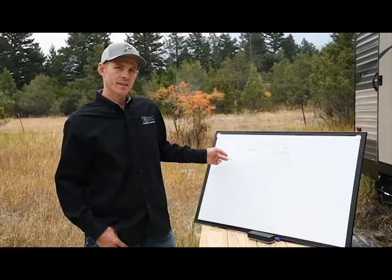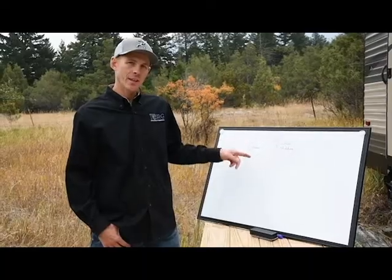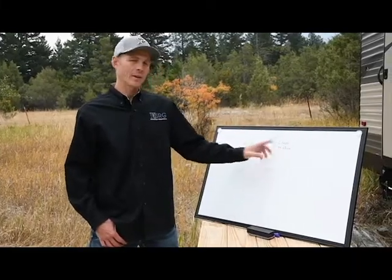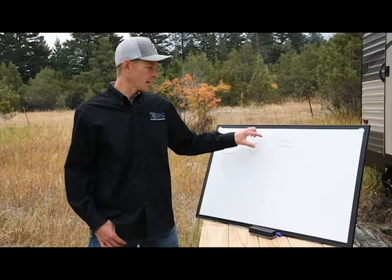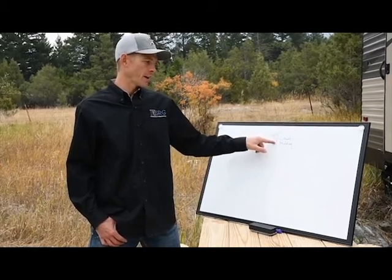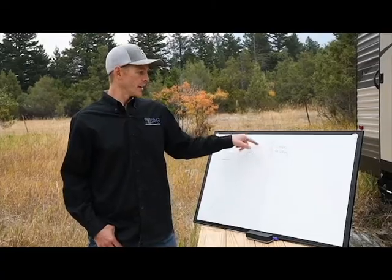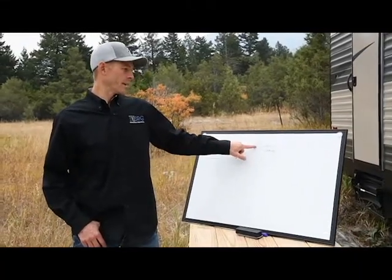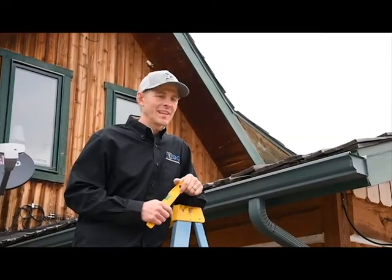To recap: plumb fascia is the simplest and easiest installation. For angled fascia you can use the T-wedge, T-strap, or wrap-around depending on the angle profile. We also have a lot of crown molding in this area, which can be more difficult. The problem is when you pitch the gutter using a T-wedge on crown molding, the wedge ends up in different spots and you don't get a consistent angle. In that case I'll use the Raytech T-strap, which takes some of the load off the crown molding itself.